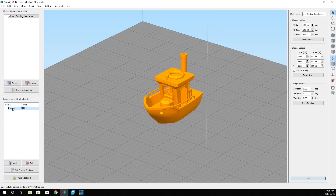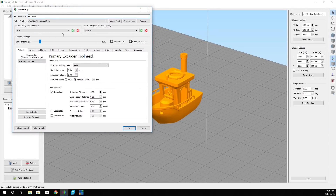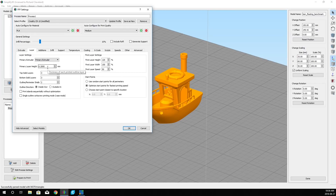If we go up to our process and double-click, we're going to use PLA on medium settings. Layer height is 0.2 millimeters — a fairly coarse layer height. We're going to do three top layers, three bottom layers, and two walls, printing from outside in. We're not going to worry about islands or optimization. We'll make our first layer height 150% and layer width 105% for good bed adhesion.